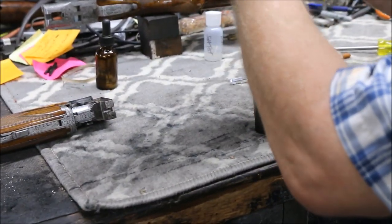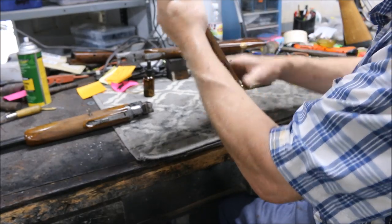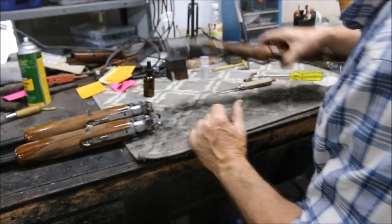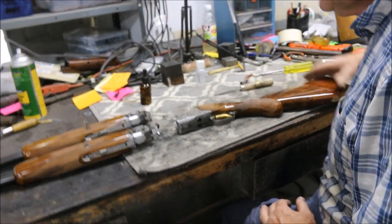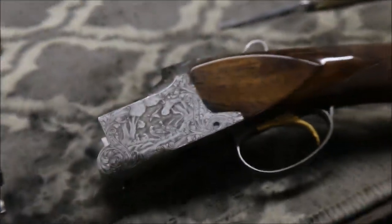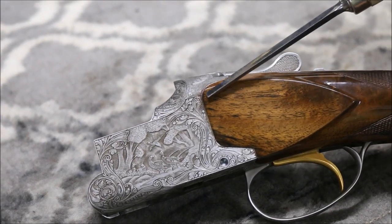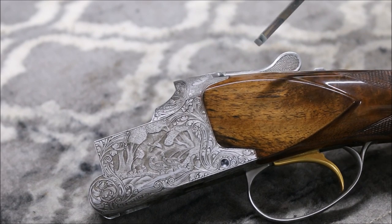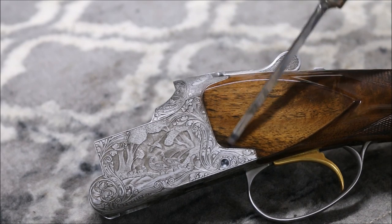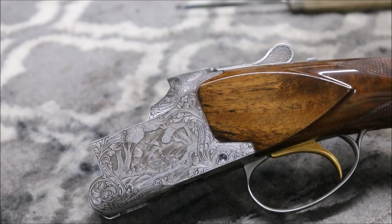Let's put this back on. I'll put these forearms back on later and write a nice letter up to the owner of these guns telling him what we found. Now here's the stock. I really don't need to pull it off to tell you it's salt. It's not a bad one, but it is salt. It's got a little rust around here where wood meets metal, and the salt damages and erodes the wood away — it's kind of turning black and the wood just disintegrates from that salt content.